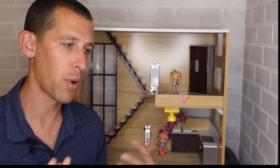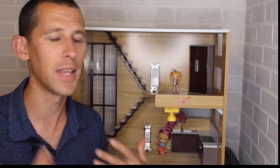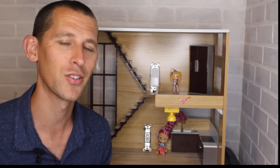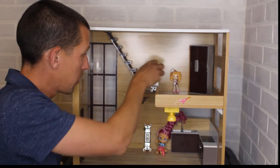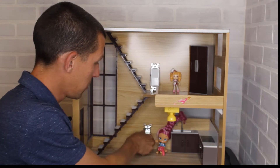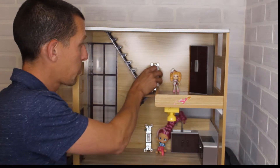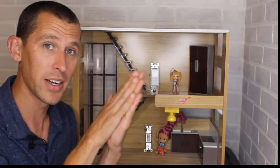What this creates is an OR circuit. If you're an electrical engineer, you might want to correct that terminology — a dumb mechanical would call it that, and yes, we dreaded electrical engineering classes because that stuff's hard. But what we've created is: if either thermostat says it's hot, the air conditioner turns on. If both say they're hot, the air conditioning stays on — the system reacts to either switch calling for cooling.